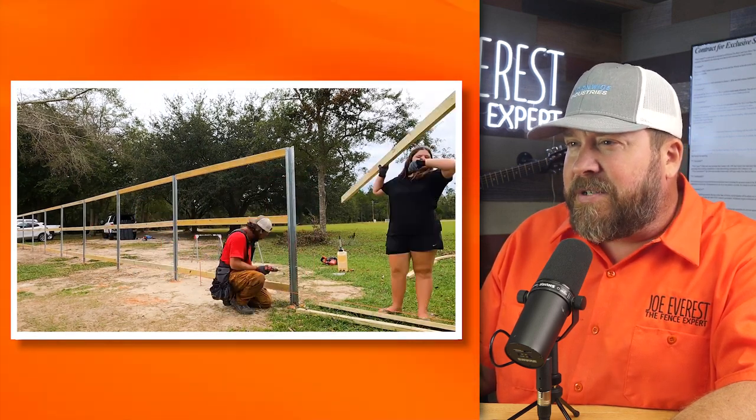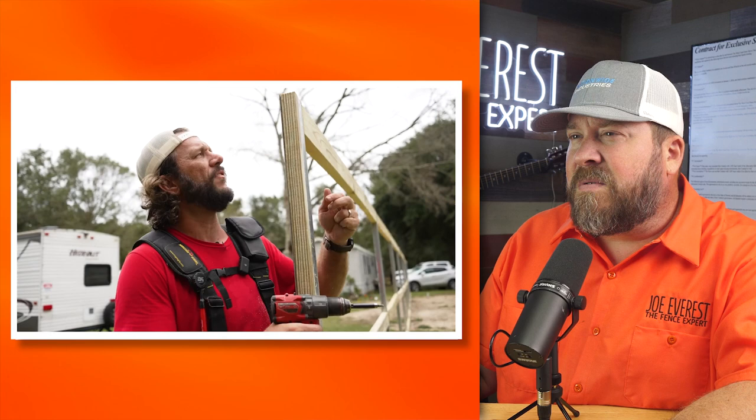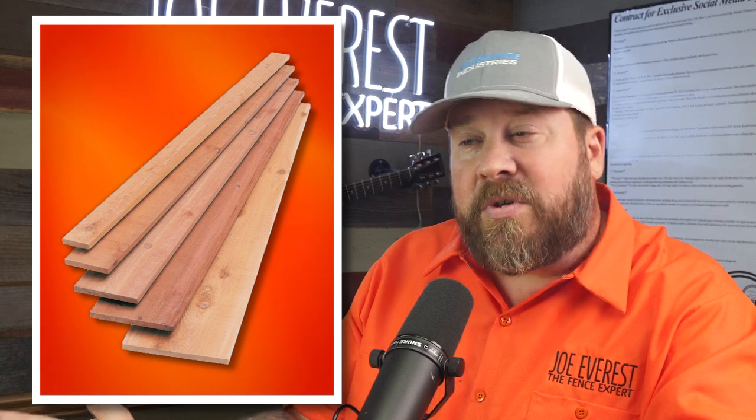Starting off, we've got a Postmaster Post — looks like Postmaster Plus with the additional holes. He's going to attach those and cap it off to dress it up at the end. You can rip a two-by-four in half, which is pretty typical. He's using treated pine; maybe cedar would be a better choice, albeit more expensive. That said, I can't think of too many fences where the rails have failed first. Where cedar has the advantage is less warping and twisting, so as you look down the top of the fence it's less of a snake motion — but it's each their own.